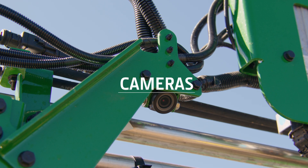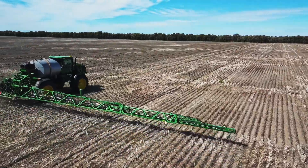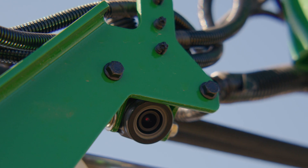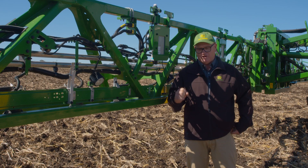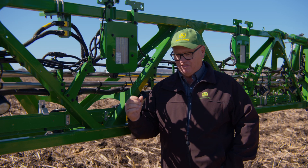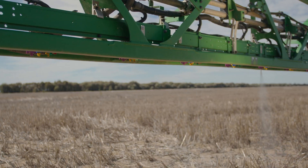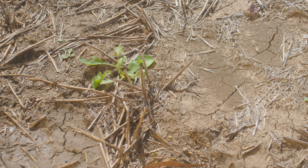We'll start with our camera. You can see it's quite small. We have 36 of these across a 36 metre boom. These are RGB cameras — red, green, blue — and what the camera is doing is looking at the ground and looking for the colour green. It's not trying to pick up vegetable matter or anything living. All it's doing is looking for the colour green on the ground. When it sees that colour green, the system makes the assumption that green in a paddock is a weed.